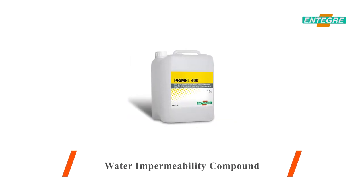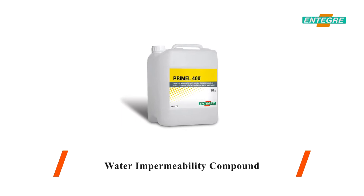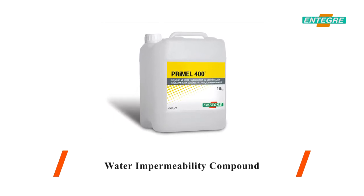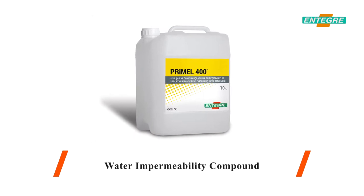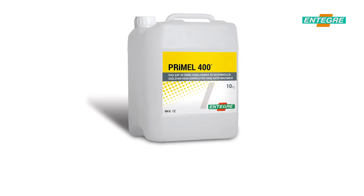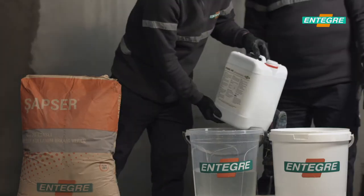PRiMEL 400, an air entraining additive, is used to provide water impermeability in plasters, masonry mortars and screed. It improves resistance to weathering in interior and exterior plasters. PRiMEL 400 is mixed with mixing water.